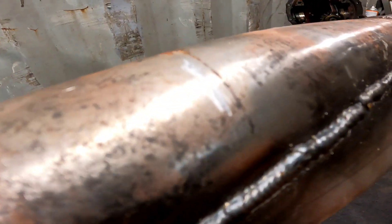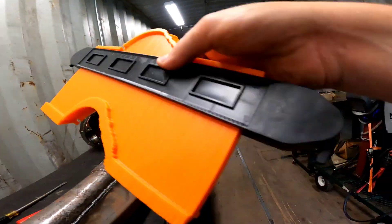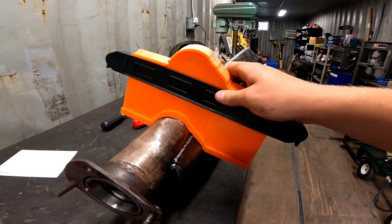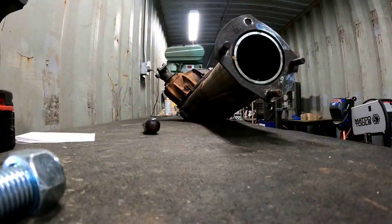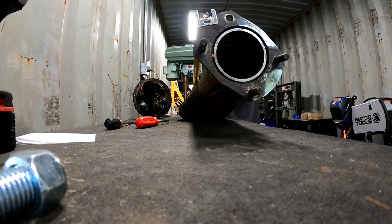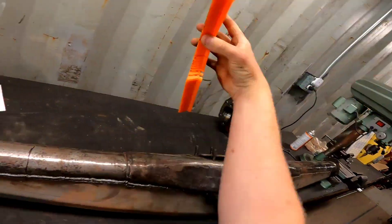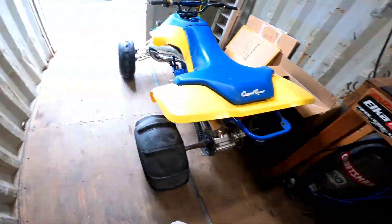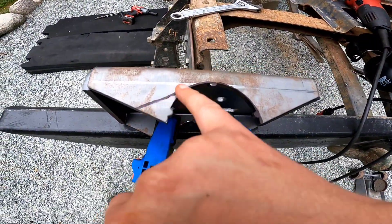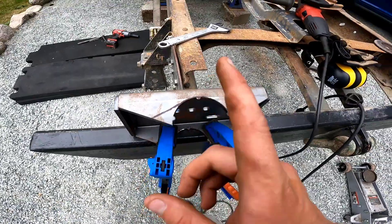I've marked my spot — you can barely see it. Basically we're going to be going right around this. It's got these dual locks on each side, and that's basically the shape we're going to need to fit around the housing. So I've got my angle fitting for the inside and outside of one perch and have them transferred over. I've got to cut this section off and grind back just a little bit around here — I'll probably have to do a little bit more. But let's go ahead and get that ground down.